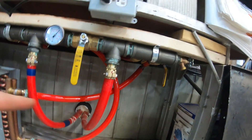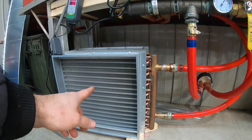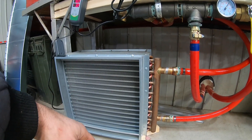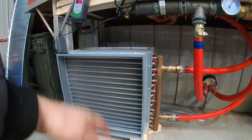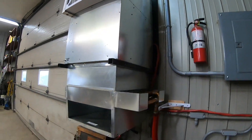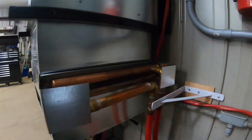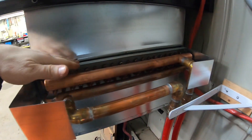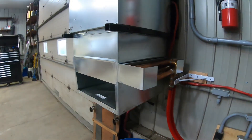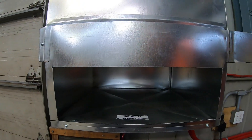Underneath you can see the valves — two ins and two outs. One is for a temporary heater that I'm going to reuse in the woodworking workshop. By the time I install this one here, you can see the heating coil: 20 by 20 inches, supposed to produce about 80,000 BTUs.